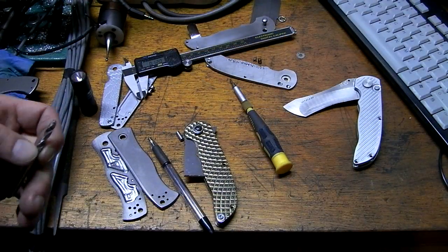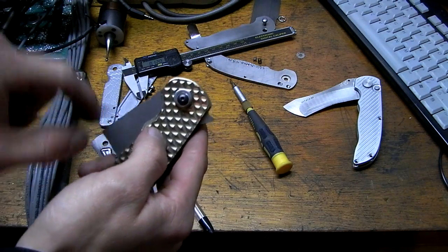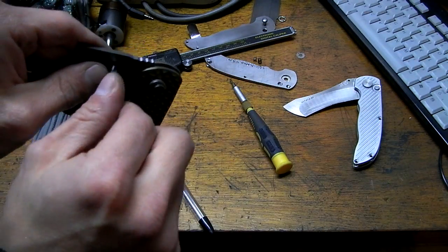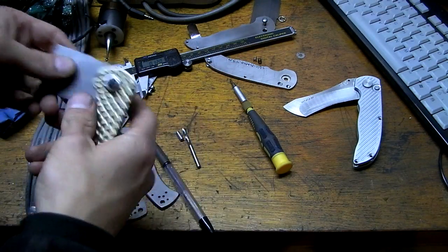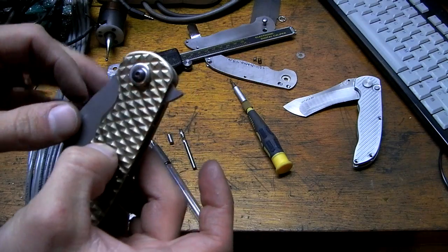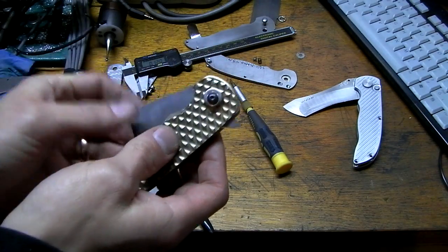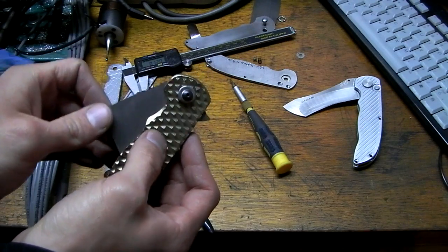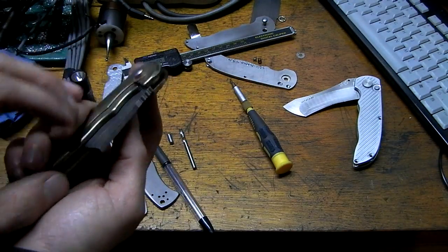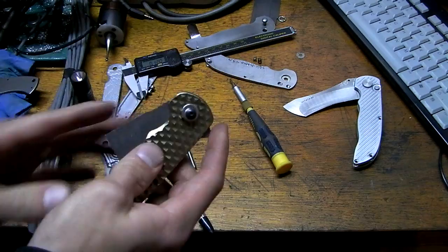Okay, I couldn't help myself and I can't stay away. The little hole, that's the 1/16 inch hole we drilled into the blade, I put a tiny little chamfer on it by hand with a bigger drill bit, just about 4 turns. That put a little bit of a V going into the hole so that the detent clicks in there. And I took the file and reworked the grooves where the stop pin goes front and back so that they don't drag at all. Now the detent I'm feeling is completely due to the ball and the tension, and it's perfect.